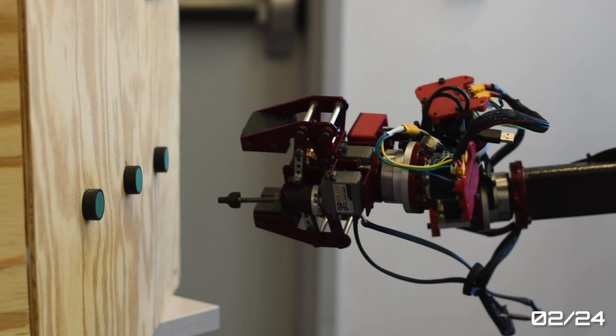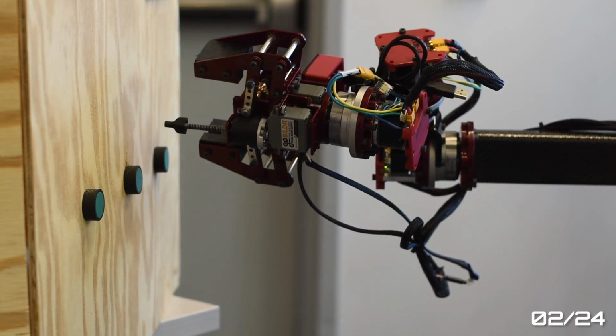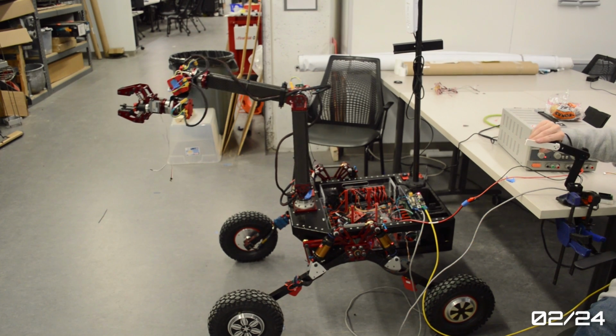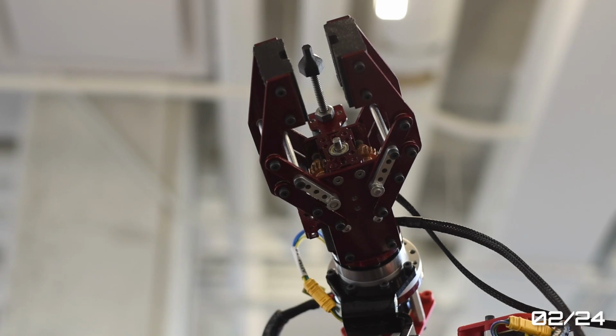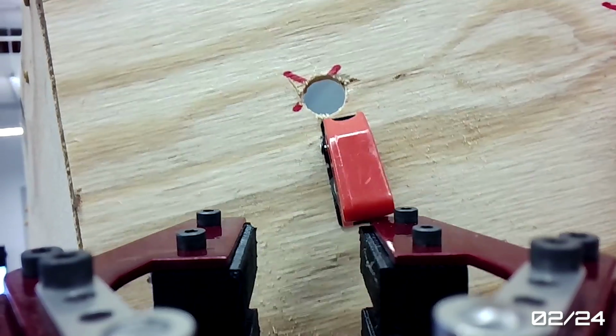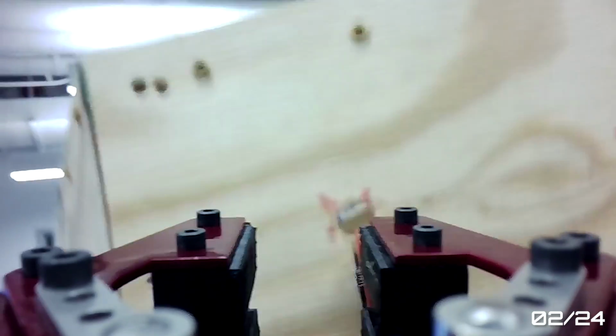Absolute magnetic encoders are fitted on each actuator, allowing for absolute position control using inverse kinematics and additional control using a new dedicated miniature arm controller. A parallel end effector is mounted at the end of the arm with an integrated camera and laser to aid in manual operation for high precision tasks.